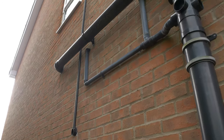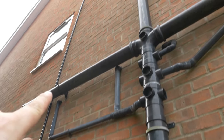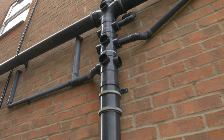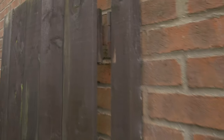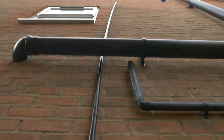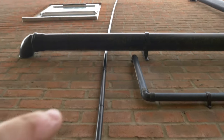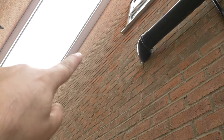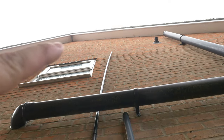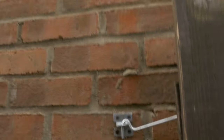It's a bit windy out here so I'm not going to film for too long. You can see the conduit on the outside — that's going to run up the outside of the building into the loft. There's a pipe already there anyway. We've got the triple extenders going up, and when we get into the loft I'll show you that, because the solar panels are on this elevation of the property so we need to take the cable up through the conduit in the loft to a point that makes sense to then wire out to the panels.